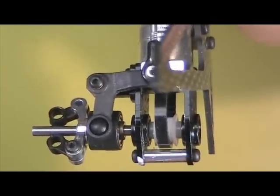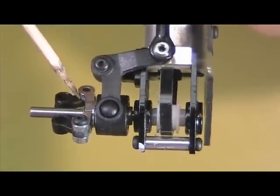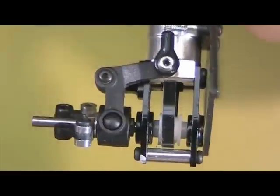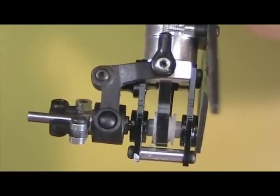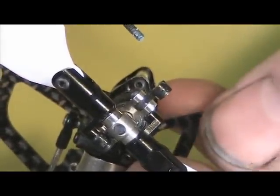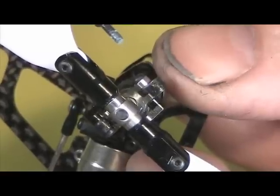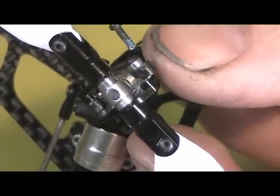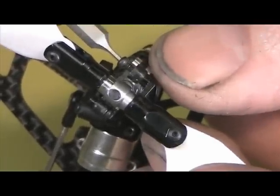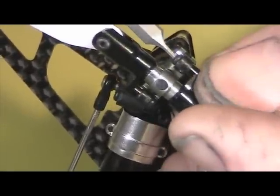The pitch slider is smooth now and we've gotten rid of any drag there. Keep in mind the main culprit was the actual binding of the inside of the pitch arm groove with the outside of the link. We'll put the rest of it together and see if it's still smooth once totally assembled. Be careful when passing the screw through the bushing — put the bushing in the arm first so you don't have any chance of getting Loctite inside the plastic where it would degrade the plastic or tighten up the fit.